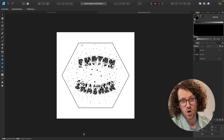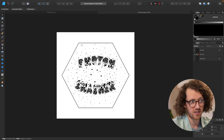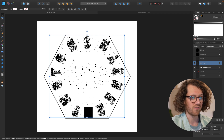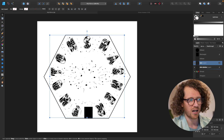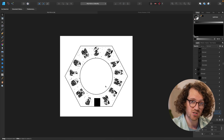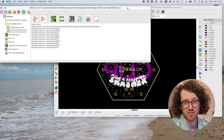First of all, let's have a look at the artwork. What you can see at the moment is the current version of the circuit board. What we need to look at doing is positioning those letters so they are around the edge of the PCB so they are visible when the circuit board is attached above it. By moving the text, it's left empty spaces, so we need to look at moving all of these parts so that they fill those gaps and so it kind of feels the same. All of the text is now nice and legible between the solar cell and the edge of the circuit board. What we're going to do now is import this graphic into KiCad, which is the free and open source software that I use to design the PCB. And whilst I've got that software open, we can look at making the other changes. So we're in KiCad and the first thing I want to do is import the new artwork and just see how it feels, because things might need adjusting once I see it in the context of being on the circuit board. I've dropped that in.